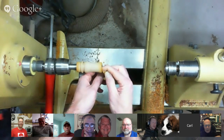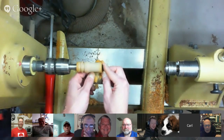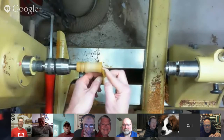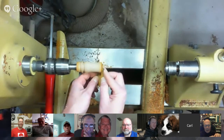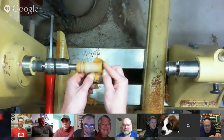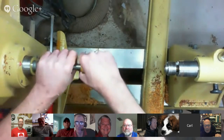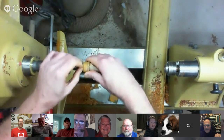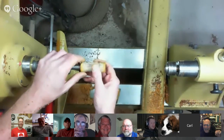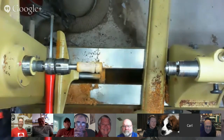At least what I do on my resin casting is I usually dry sand to 240, depending on how rough the surface is, wet sand with 240, then take it up to 400, 600, 800, 1000, and if I feel fancy, about 1200. After that, all I use is a little bit of Meguiar's plastic polish. That brings it out to a mirror polish. Oh, really? I've never used the automotive sandpaper. Yeah, just your regular black stuff works perfect.